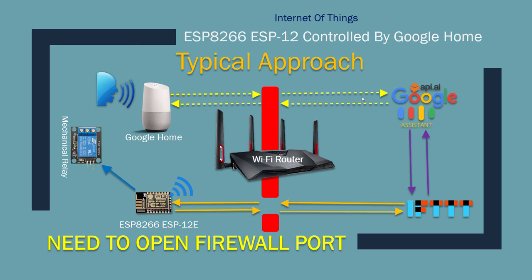That's the typical approach. You could also set up reverse proxies using ngrok or other services, but the problem is some cost money, and ngrok can't run on the ESP board because it has no OS. On a Raspberry Pi you could run ngrok for reverse proxy, but the ESP8266 is small, has no OS, and doesn't have much flexibility. So for this project we're not going to use IFTTT — we're going to replace it with our own solution.